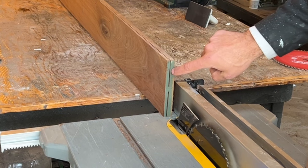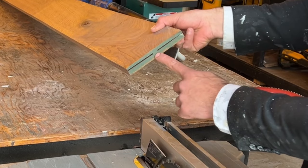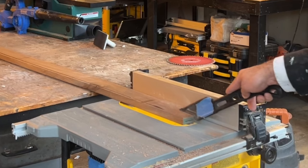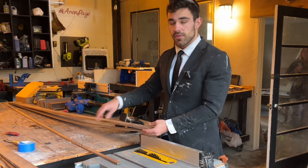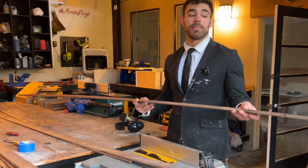I'm just finishing up here. I got this side done and then flipped it to get the other side. I leave a little bit left over — this is important because if it were to go all the way through, the board might fall on the blade and shoot back. Since I don't have a band saw, I'll rip this through the table saw and only waste about three-eighths of an inch. Running it through flat gives me two pieces: a quarter inch and just about half an inch on the bottom.